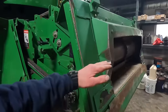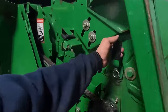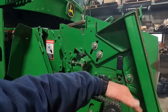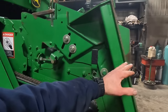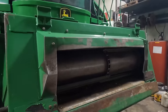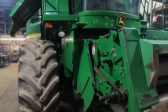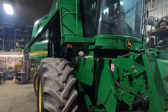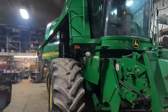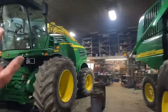We also have to raise the drum for straw. You just do that here. You just switch the position around, and that's got the drum down right now. So we need to raise that up so that there's a little more room for when the wheat and straw and whatever goes into the combine. So we've got a little bit of work to do here, but we'll go ahead and get started, and then we can get the combine put into storage and the chopper.